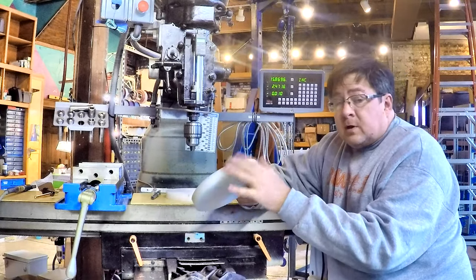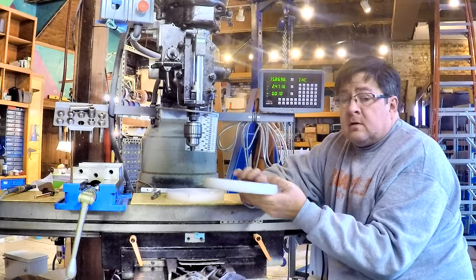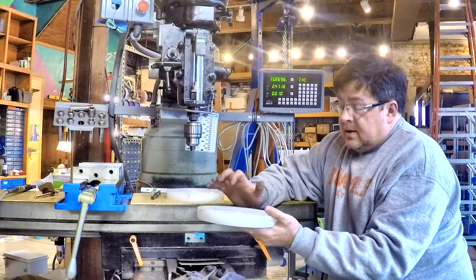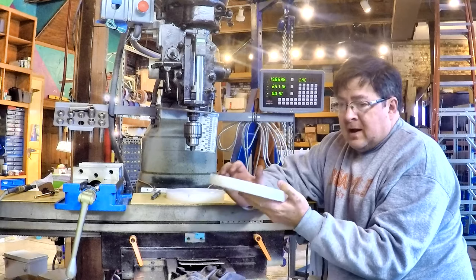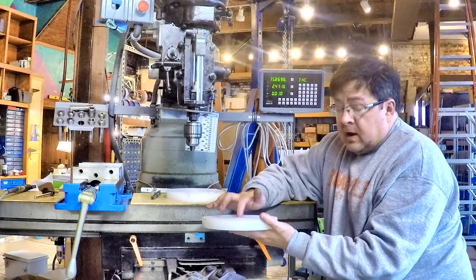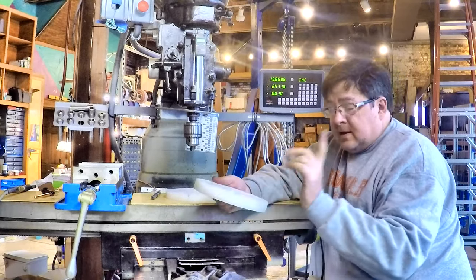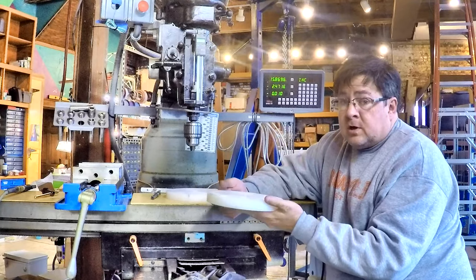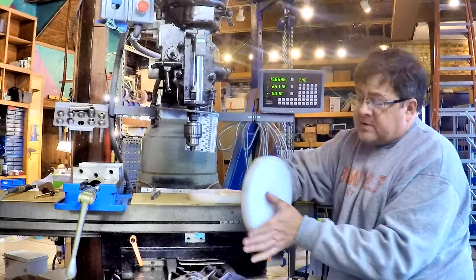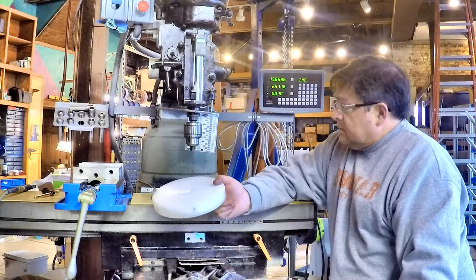What I need to do in order to be able to cut that groove with that form cutter is hold it on the rotary table. So I drill three holes on this plate so that I can mount it to the rotary table with studs and center on the 5/8 inch center hole, and then I can make that form tool cut that you've seen me do before. I've got two more to do, and the process I'm going to go through today is laying it out on the mill